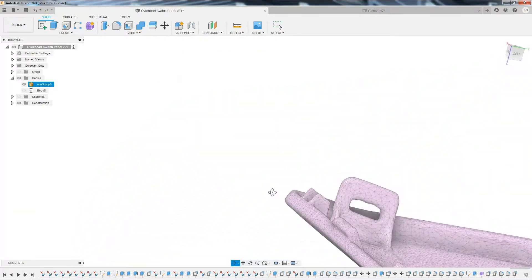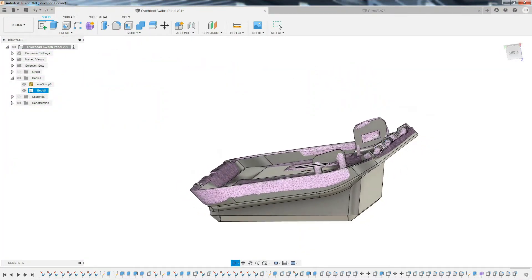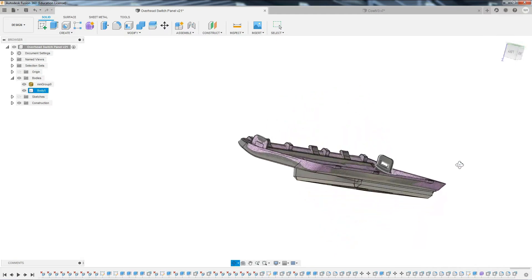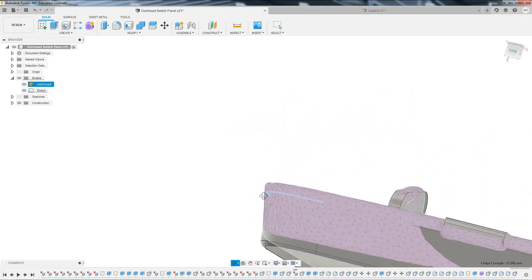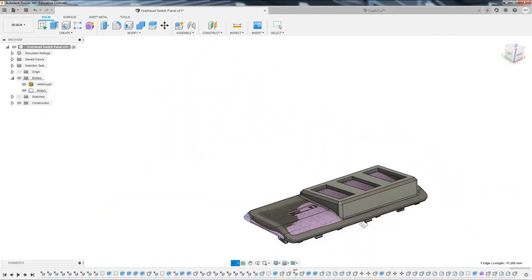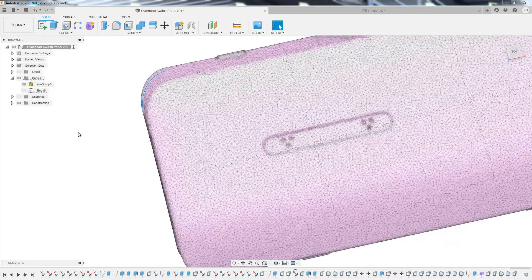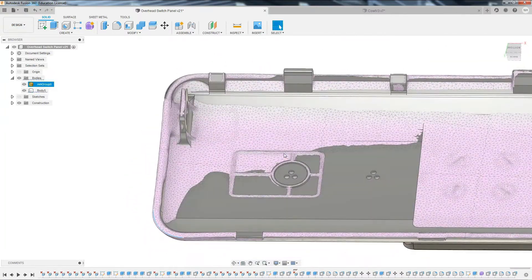That's just because it couldn't see that spot, or it was slightly too reflective, whatever the reason. So I just match it to my best guess, and it is pretty close. We're only talking about variances between the edge of the model and the mesh — it might look like a lot, but it's less than a millimeter, half a millimeter at most in most cases. So fitment is very good. There's the alignment features you can just barely make out, and these are actually for the microphone pickup for the Bluetooth audio. This part seals up against a foam surface to kind of isolate the sound.